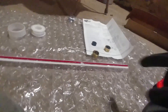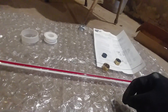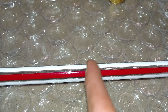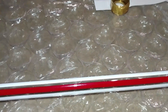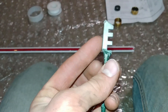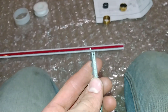I measured it up there and figured that we need it to be exactly 16 inches and 3 eighths. A little scratch in the paint is our mark, and there are a couple different ways that you can cut this — like I've seen where people use a triangular file and they file it and then gently snap it. All I have with me is a small glass cutter, but these can also work, so we're going to go ahead and use this to cut the tubing.